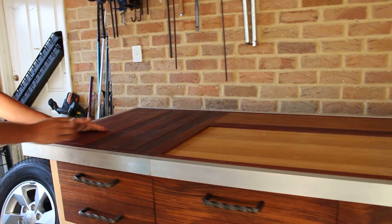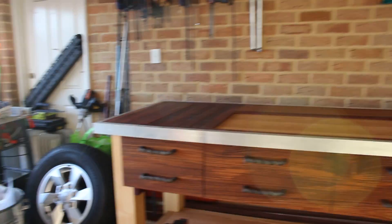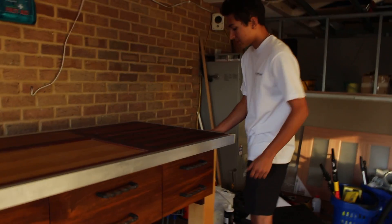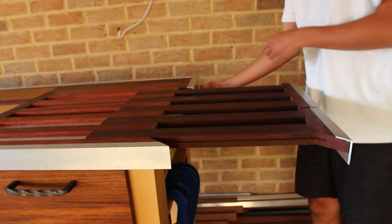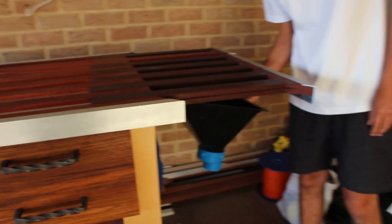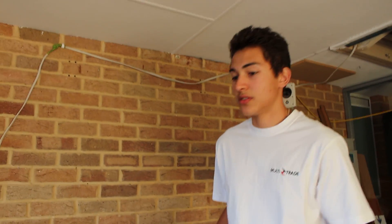On this half, the bench extends out this way, so I can work sort of in a big L shape. I can clamp pieces directly to the bench on this side. On this side it comes out this way — if I'm working on pieces of timber, it's also good for sanding. I have a dust extraction unit here which just mounts to the underside of this, and I can attach my shop vac directly to that, so when I'm sanding I get good dust extraction. This can slot away.